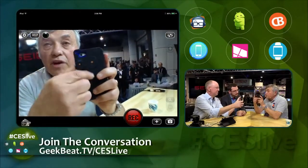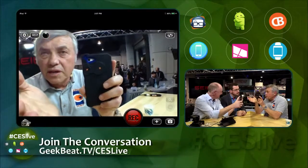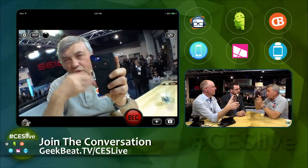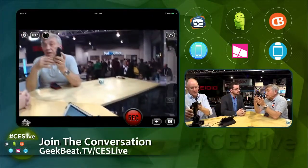So when you build all these sensors into the case, are you communicating with the device via Bluetooth? Yes, excellent question. You can see on the backside — that's a Bluetooth module. Unfortunately, Apple doesn't support NFC, near-field communication, so we have to use Bluetooth here, which means we need a battery. That's the battery compartment, which lasts almost four years, so you don't have to change it. For Android-based devices, we will use NFC, and with NFC we can harvest energy — we harvest energy from the RF signal emanated by the phone, so we don't need any battery for that.